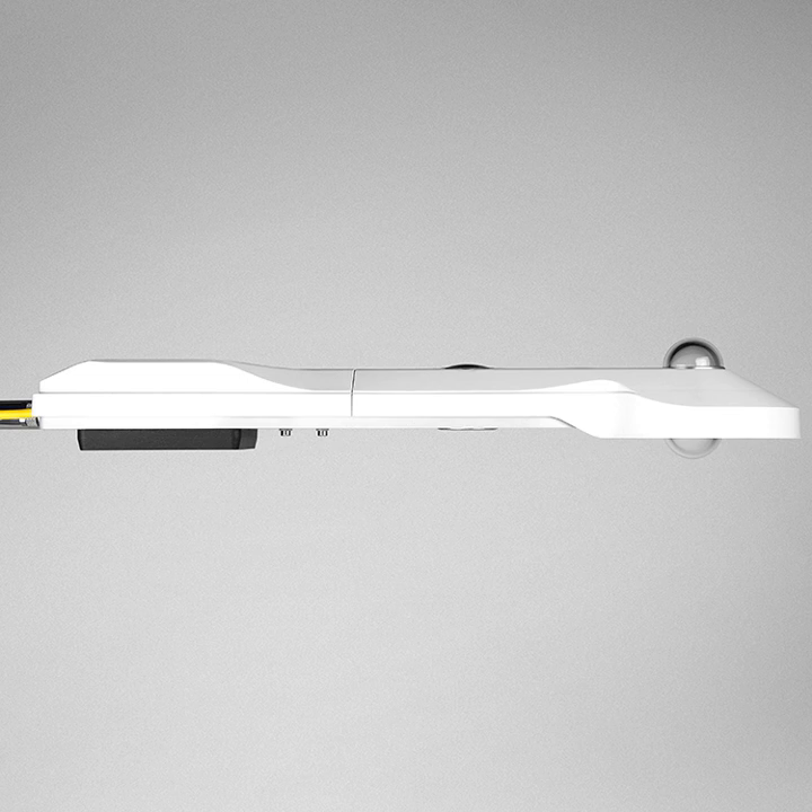The upper receiver measures the direct solar radiation plus the diffuse radiation and the radiation at longer wavelengths emitted from the sky and clouds, while the lower receiving area measures the solar radiation reflected from the ground (albedo) and the longer-wavelength radiation emitted from the earth. The instrument is designed and constructed to be used outdoors in any weather conditions. Besides its use in meteorology to measure energy balance, it can be used indoors for the measurement of radiant temperature per ISO 7726.